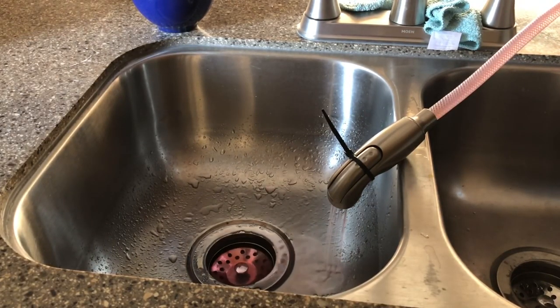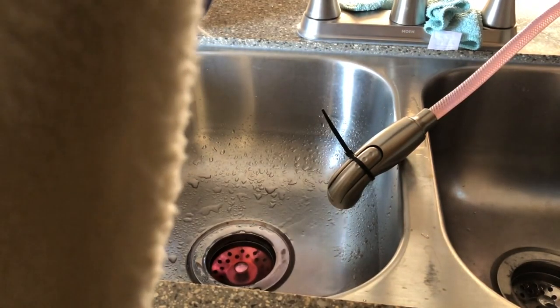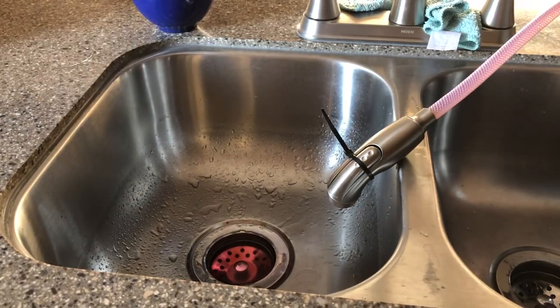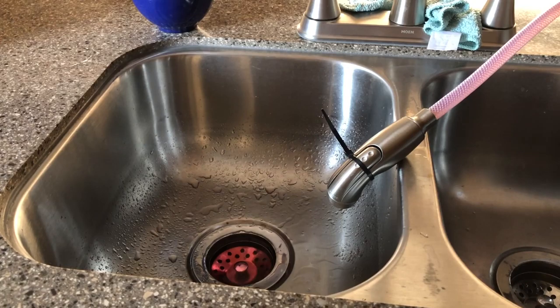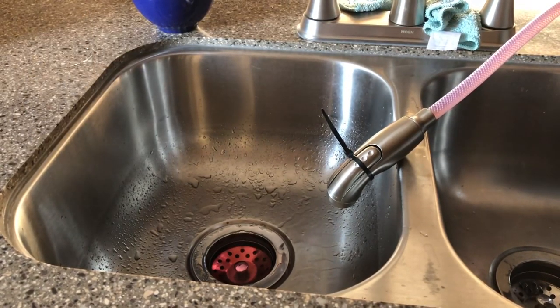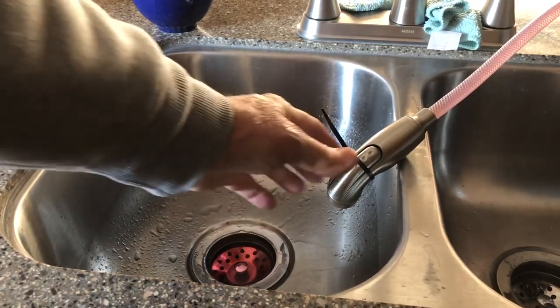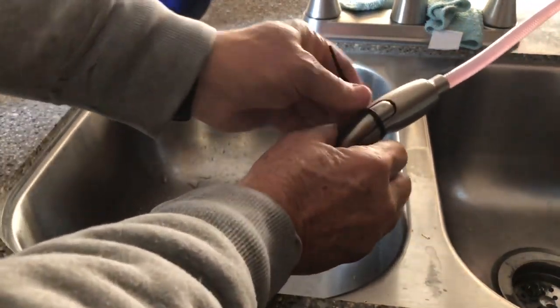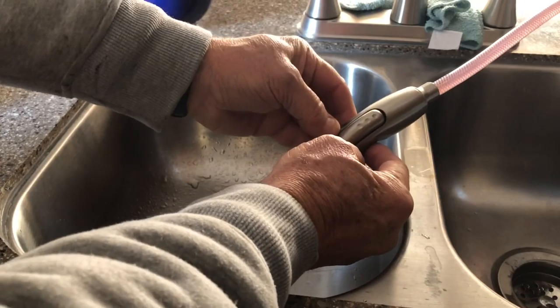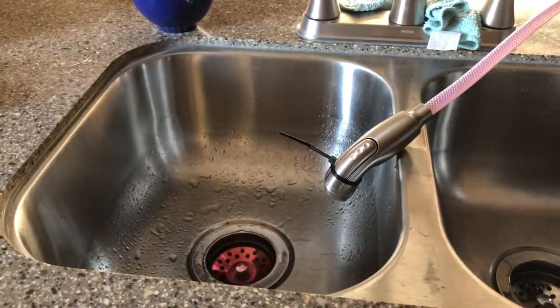What I had to do is turn the valve off and pump it up with some pressure, and then basically hold my thumb over the end of the faucet. Now you can see there's pink antifreeze in the line. We can clip this off now.